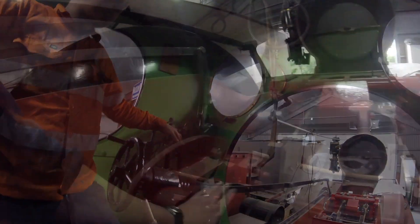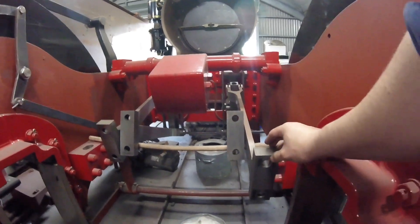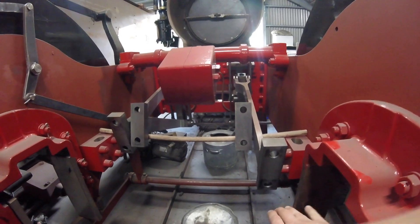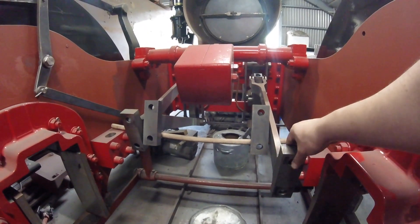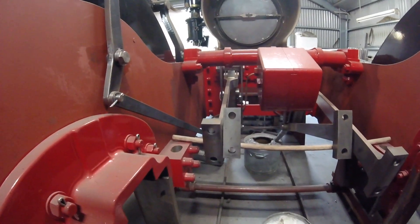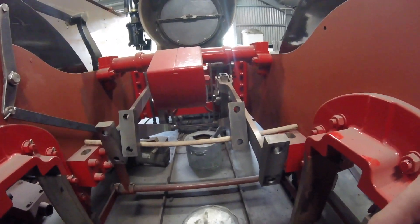The simplest way is always the best sometimes. One of the drive wheels through here, isn't it? Yeah, so we've got some bearing blocks that are going to live in here. And then these are the arms that drive onto — did you say it's like a cam? Essentially like a cam type crank setup? Yeah, ish. Two eccentrics which run inside jackets. So there's eccentrics that run inside jackets that get run off of these arms, and Jared and his dad machined all of these out of billet.